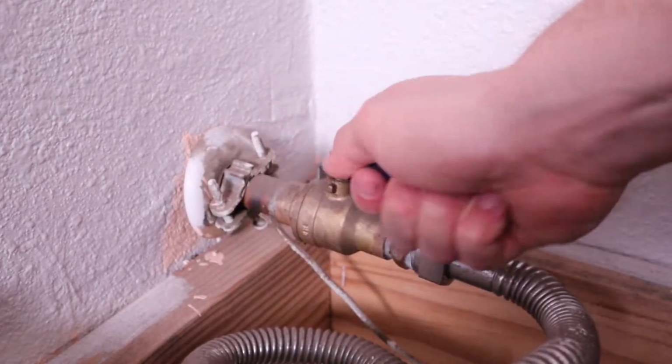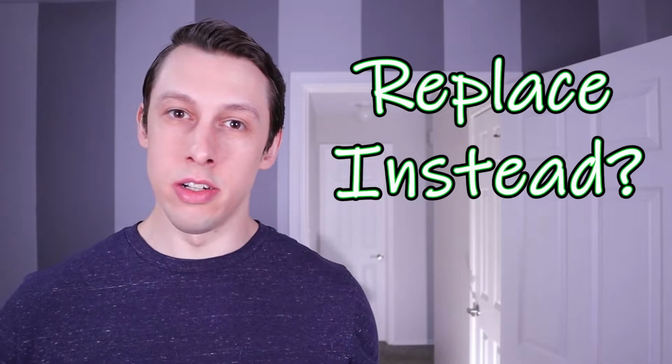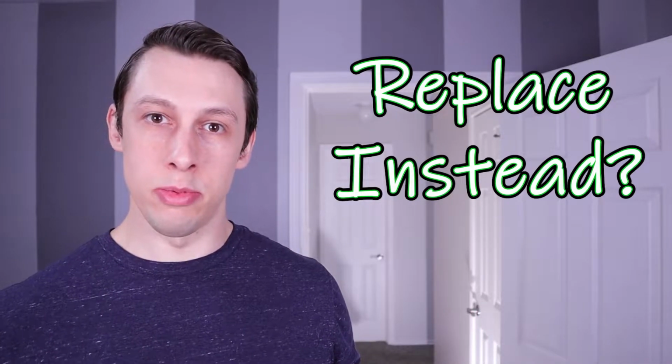In this video, I'm gonna walk through draining this water heater step by step as a first timer, filling it back up, and some things I learned along the way that, if your situation's similar to mine, may make just replacing the heater a better option.